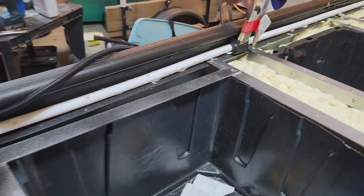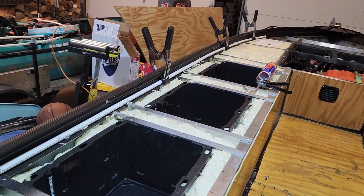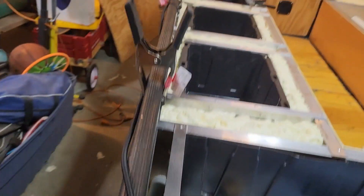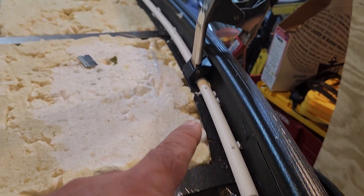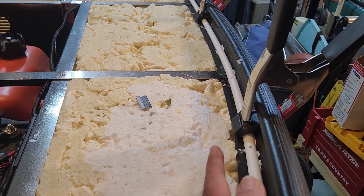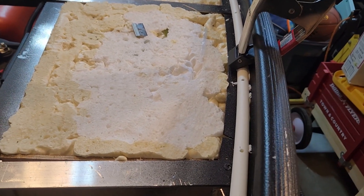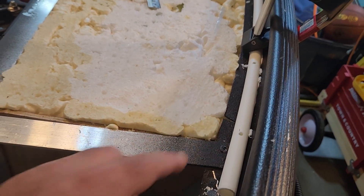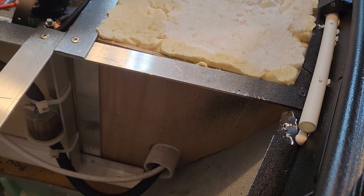We have that bead of marine adhesive holding on this half-inch piece of PEX, and that half-inch piece of PEX is running all along the finished component of the boat. There's some overhang where it runs down into the unfinished portion of the boat on both sides. The general idea, with holes drilled at intervals all along, is that my boards are going to come in and butt up directly against this. There's going to be silicone that seals on both sides, creating a watertight connection between the floor and the wall — with the exception of these drainage holes, which run into the tube. These holes do not go all the way through; they just go into the tube. So as water collects here, no matter what happens — the boat rocks back and forth, side to side — water is going to dump into the unfinished portion of the boat.